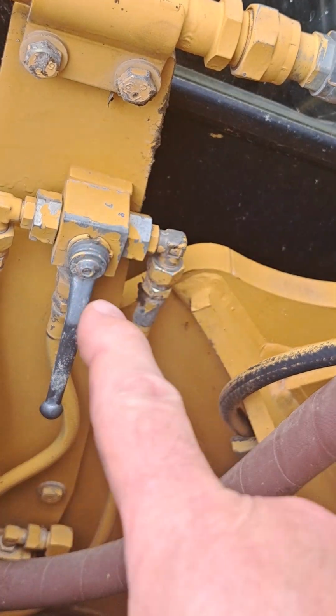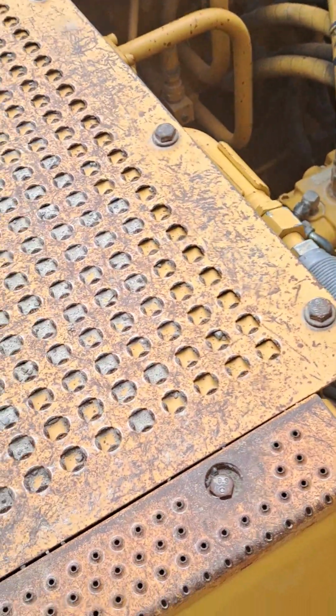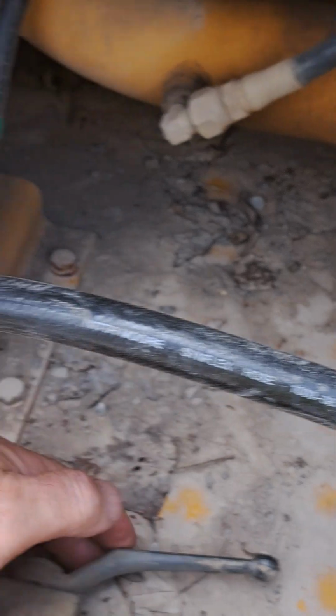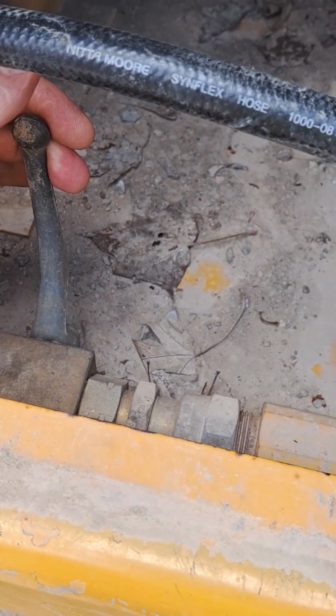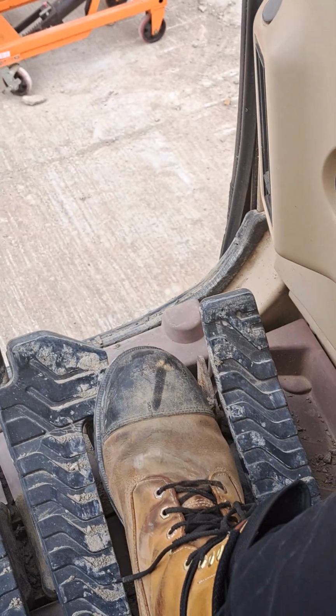So by turning that valve closed, I put this machine into one pump flow. Whether or not I go into the pump compartment and shut off that other valve is not really going to be any consequence, because this hose is feeding a directional control valve that's not going to shift anymore anyways, because I'm not sending pilot pressure there. But just for process, I'll close this one too. That will ensure that we do not get two pump flows. We'll just see again how much flow we get with only one pump feeding our auxiliary circuit. Just start it up again.